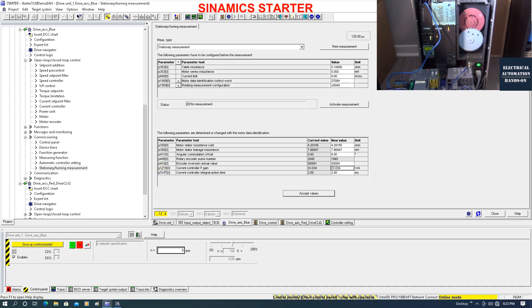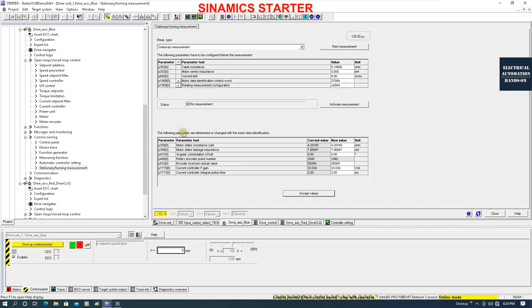In this system I am using a Siemens drive and Siemens servo motor, so we do not need to do the turning measurement function because the drive stores all those pre-configured parameters. But if you are using a third-party motor, you can select the turning measurement so the motor can spin and be identified more accurately. In this application using a Siemens drive, I do not need to do that. This step is done - we have identified some basic parameters from the motor.